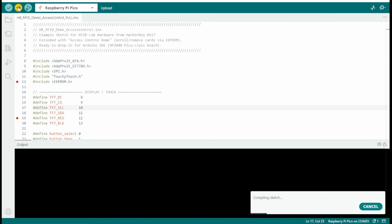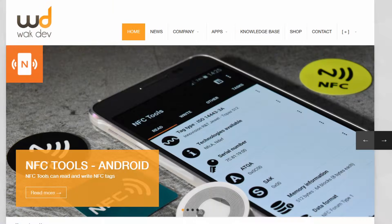After that I spent some time trying to put together a rudimentary proof-of-concept access control demo with a small database on the 2040 — where you could enroll a card, then present it to get a green light pass or fail. You could extend that to driving a relay or pulling a mag lock, but I ran out of time. If anybody did anything cool with it, please let me know in the comments.